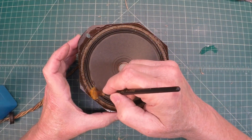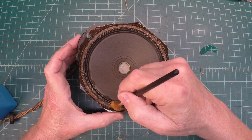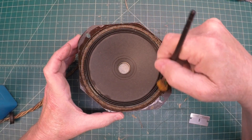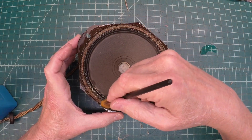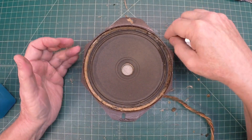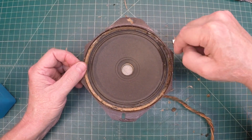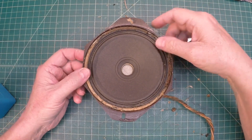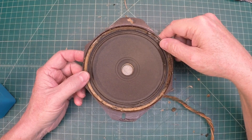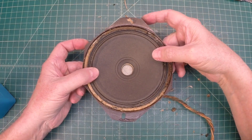I'm going to let that soak there for a while and keep it nice and wet, then come back and check in about 5 to 10 minutes. I've finished cutting around the speaker cone as best I could — just a few little nicks there in the cone. I've also removed the two fasteners from the spider, so let's see if we can pull this out now.